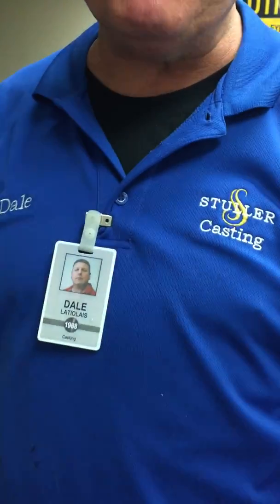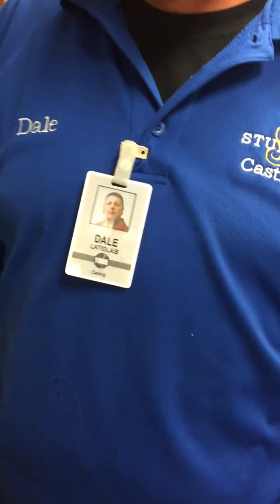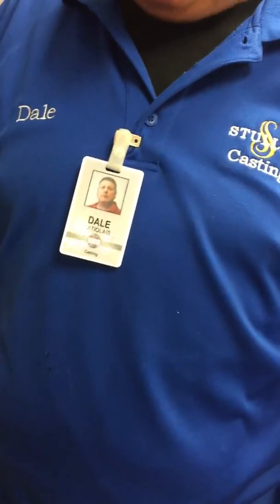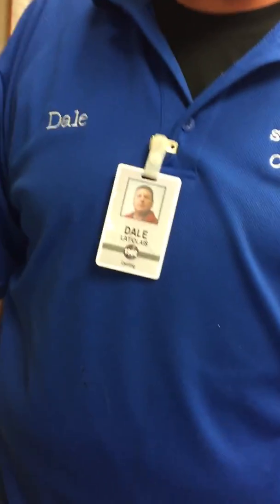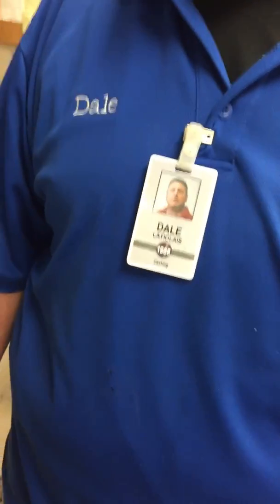Why do we use big shot, not small one? Well, it depends on where you need to polish. If it's really intricate, we'll use the small shot. But if it's just big solid pieces, we use the big shot. Because we have many new catalog pieces with many small stones in the side. All of them are close to 1 millimeter, or what size? Most of it, about 1 mil.